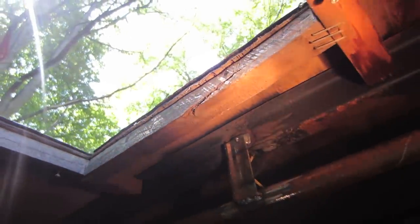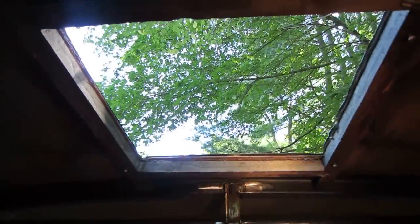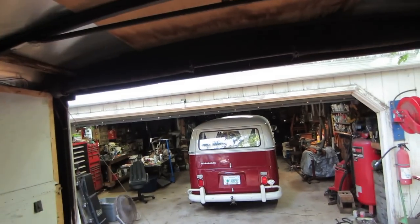Let's take a peek from the bottom. The wood has some stains on it but I really don't see any rot. The pieces I have as replacements aren't too much better than what's there — one's a little iffy, but that just looks like it's been like that since new. So we're going to go ahead and leave that alone. All the sealant is scraped off the top. It's so hot today it didn't need any heat applied — it was very, very soft. During colder weather I'd hit it with a hairdryer or heat gun. Now it's time to go get the new skylight.